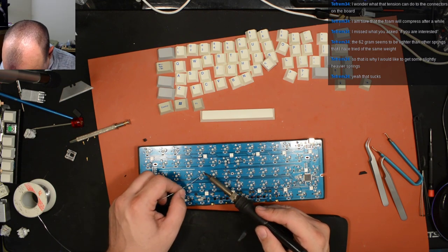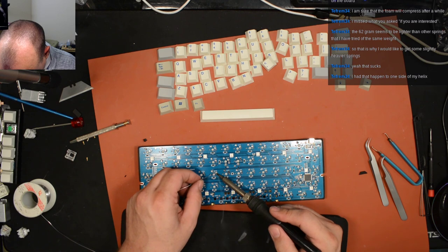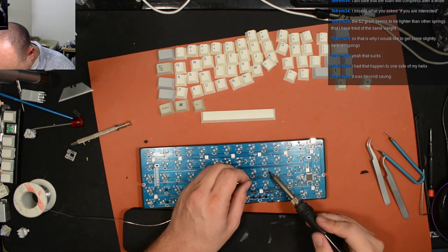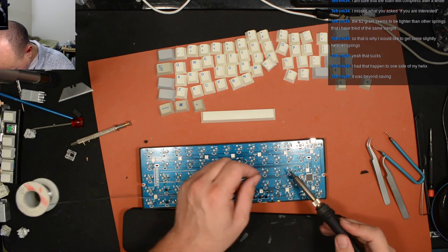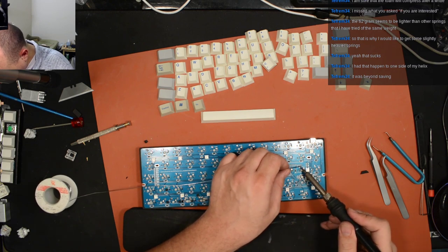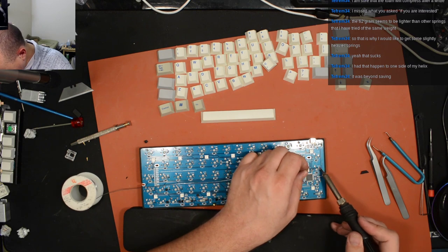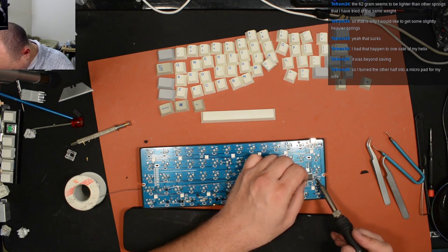So, functionally, I think it's a really cool PCB in terms of the features that it offers and everything. I just would like to see, from an enthusiast perspective, those more rugged switch holes, because enthusiasts do like to build and rebuild and desolder and all that good stuff. So, depending on who it's marketed to, it might make sense to go with a more rugged switch hole design. Because the ones that I'm talking about, the jacket is bigger, thicker in diameter. So, it's less likely for the solder to seep out to the point where it's going to pull a trace off.